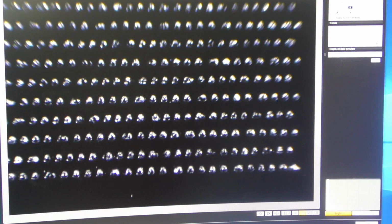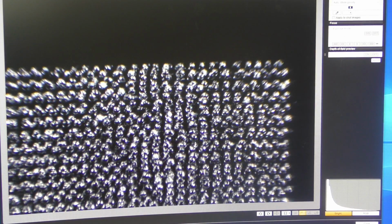Does that mean to say the PWM is not running at 10 kilohertz? Or is the speed not running at 1,000 millimeters a second? One of those two things must be wrong, because there's no synchronization at 10 kilohertz. We've got synchronization at about 9 kilohertz. So having got those reasonable results, I thought, okay, now is the time to put this back to 0.1 pitch and see how good the checker pattern is.